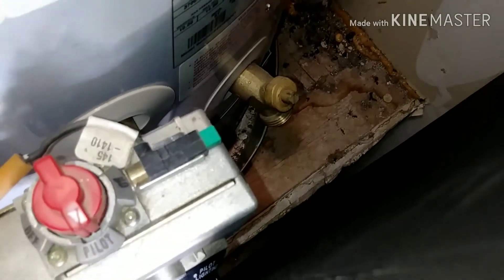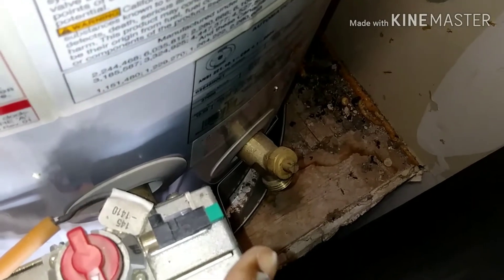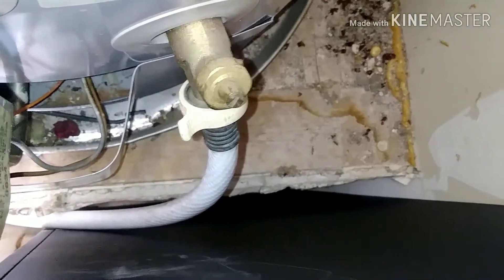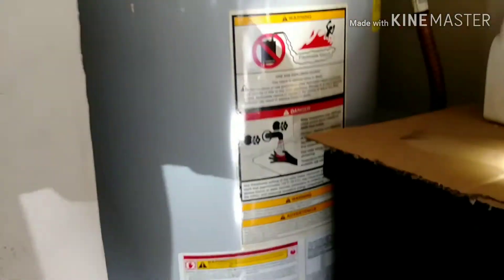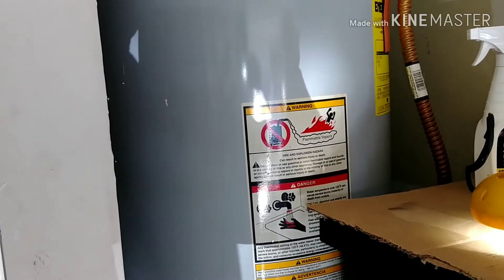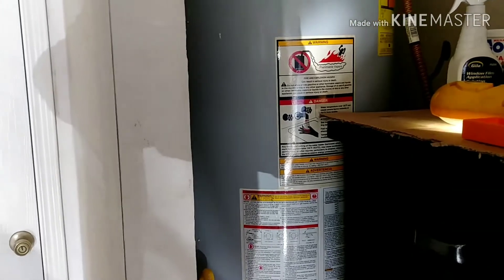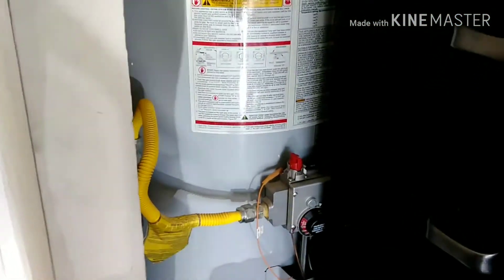Now I've prepped the burner setting and I'm going to put the garden hose onto the drain valve. I've got it snug, so when I'm ready I just use the flat screwdriver and turn the valve on and the water will come out. Remember this is hot water. This is a big tank — it has a full capacity of 40 gallons. It was a smaller tank when we bought the house, but the inspector demanded the builder put in a bigger, more efficient water heater.